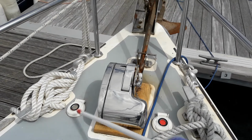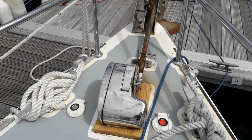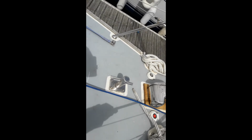These two controls are up and down, but remember it will need to be turned on at the switch behind your legs when you sat at the navigation table. Once the anchor has been deployed, there is an anchor strop in the cockpit locker with a chain hook which attaches to the chain where it goes over the bow roller and can then be secured to the Sampson post. This does two things: it's kind to the brand new windlass, but more importantly, whoever's in the forward cabin will have a much quieter night's sleep.